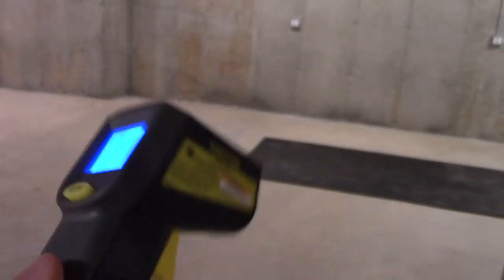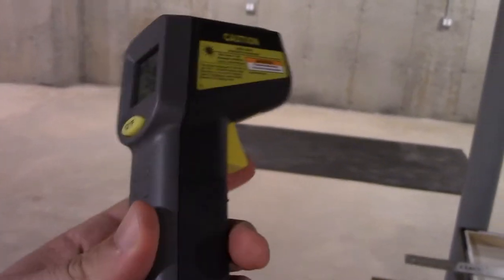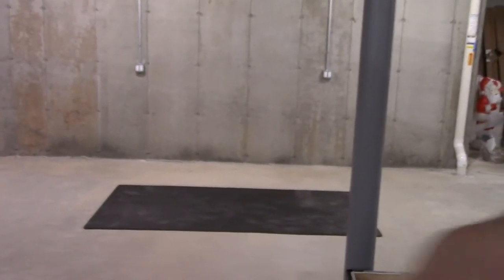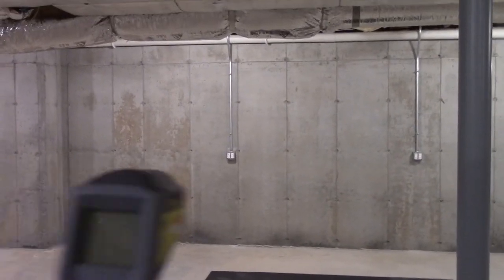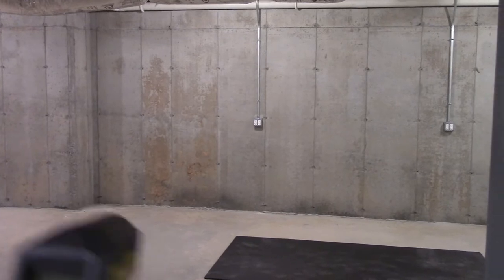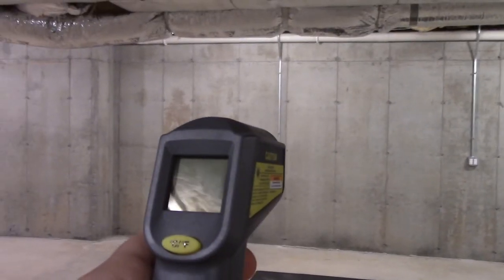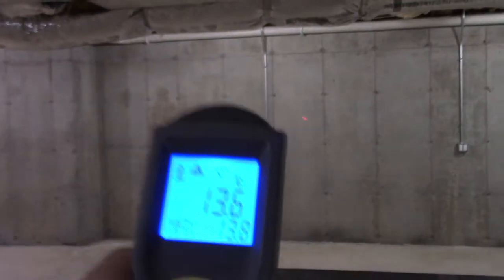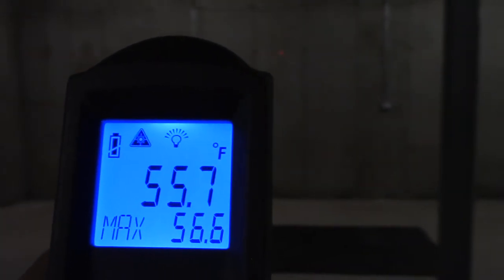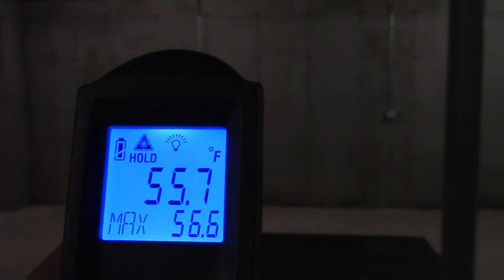This thing is pretty nice to have. I've wanted one of these for a long time. It's a very simple device — you just hold it, pull the trigger and hold it down, and it'll give you the temperature readouts of stuff. I don't know exactly what the longest distance is that it can handle, but it's probably more accurate the closer you are. Here, I'll shoot it at the foundation wall there — you can see the laser pointing right there. It's about 13 degrees Celsius, roughly 55 Fahrenheit. So yeah, the closer you are the more accurate it is, but it is pretty good with distances.